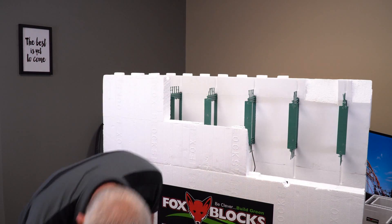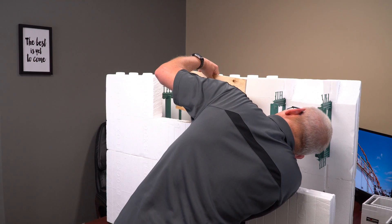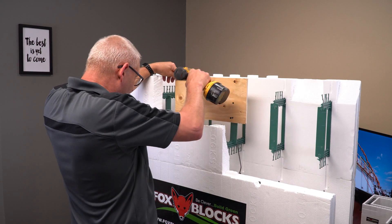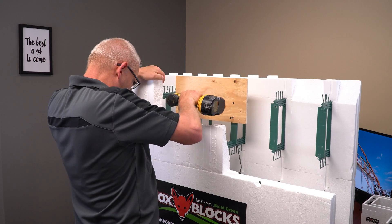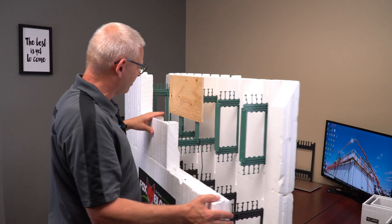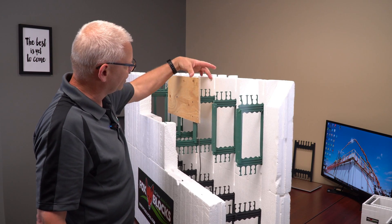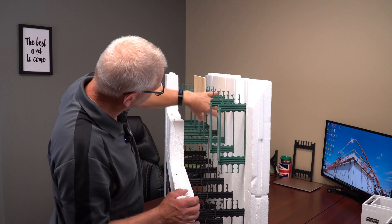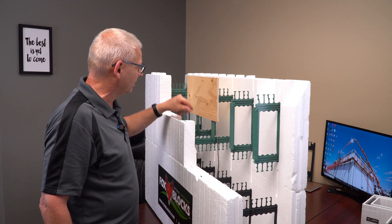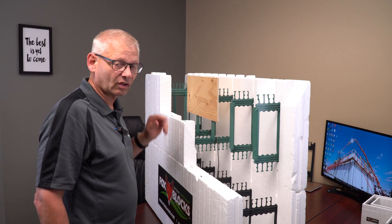I'm going to put the plywood on. For the 8-inch curb, I have a piece of plywood here — I just want to make sure that it's flush on the top. And that's about all there is to it to make an 8-inch curb. Because I've cut this taper in the front face here, I can place concrete down this 4-inch cavity, and you can see that gives me that 4-inch curb and a 6-inch shelf. You can easily put hollow core slabs on top of that, put your rebar up on top of that, and then you just remove this plywood after concrete placement — next day you could remove them and you've got a nice solid concrete curb.